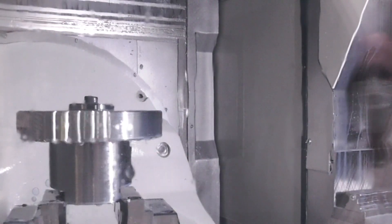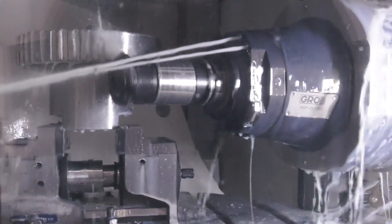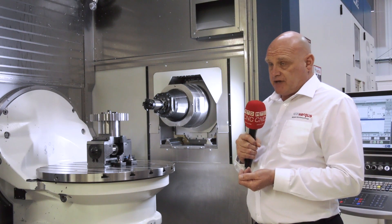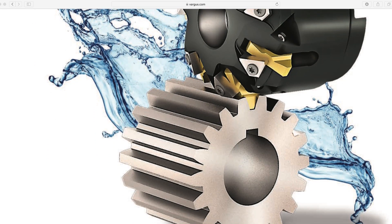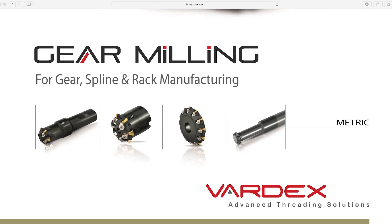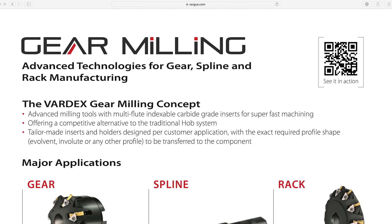The data's good, isn't it? What is the cutting data? Cutting data is very, very good. For this particular gear, we were running at about 660 RPM and at a feed rate of about 727. Obviously the benefits of an indexable cutter in terms of economy are good. So how many edges on your inserts? This particular cutter is a five-fluted cutter, and there's just one cutting edge on this particular one.